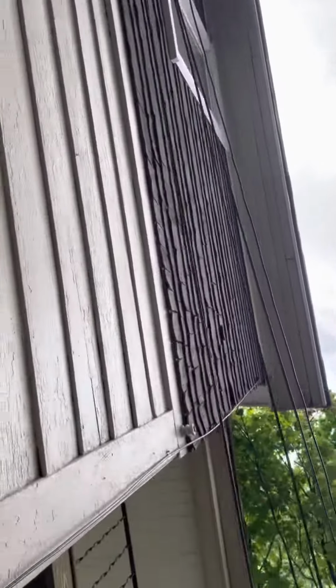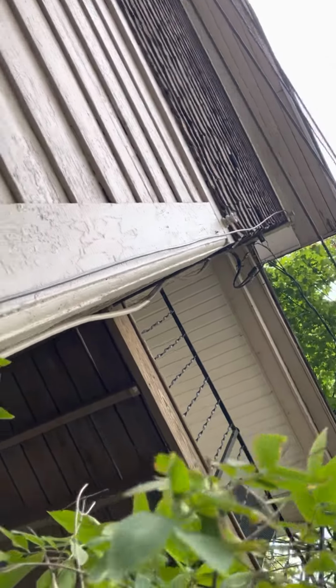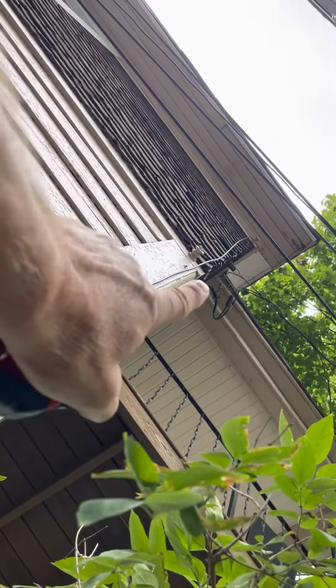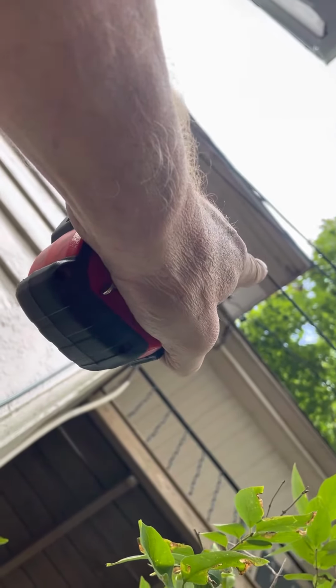Okay, over here, what we're gonna do is we're going to come out. We're gonna bring, oh wow, electric wire right there. All right, you're gonna come onto this wall with 2x6 on this back wall. You're gonna go about 2 foot. You're gonna measure 4 foot down from the soffit, and that's where the top of the 2x6 goes.